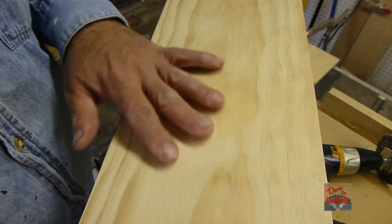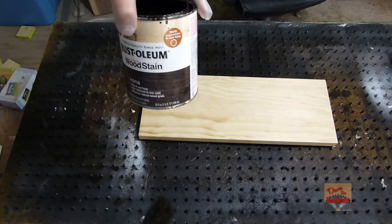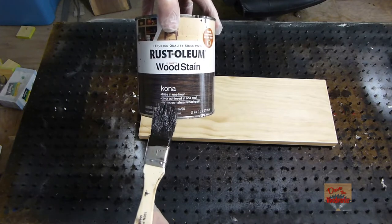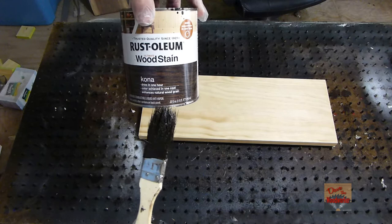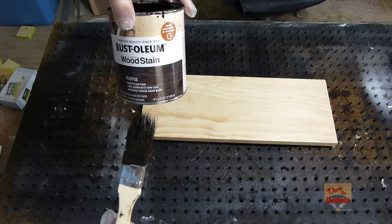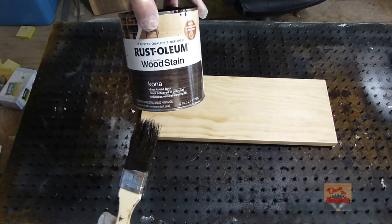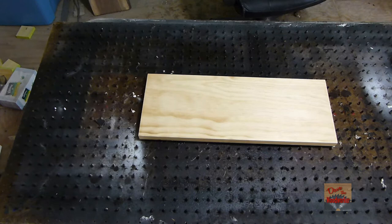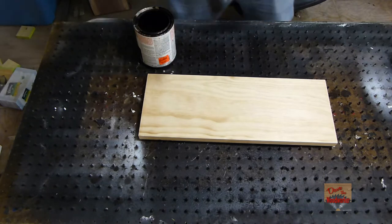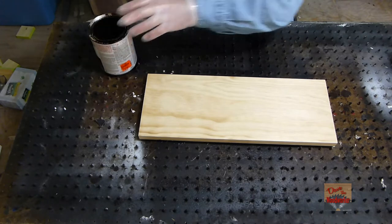So let's take this piece and stain it. I found some new stain — it's Rust-Oleum Ultimate Wood Stain, it's Kona. It dries in one hour and after that one hour we can spray it with clear sealer or anything. I love the Minwax but you have to wait several hours before you could do that, and I've tried this one already on something and I love it. I don't even have to pre-stain it because it seems to do good without it.